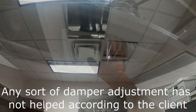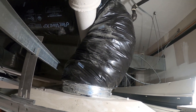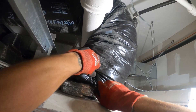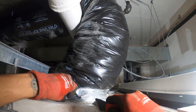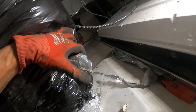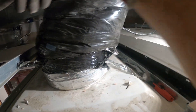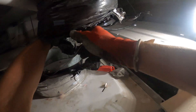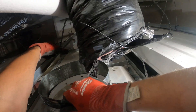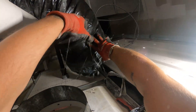Let's start by disconnecting this one. You can see the diffuser is 24 by 24 and it's a 10 inch supply. It has some tape around it so let's try to take that off — actually let's just cut this to make life easier. This is an insulated duct so behind this wrapping we have fiberglass. Looks like they just taped this one so we just have to get this off and this whole thing will free up.